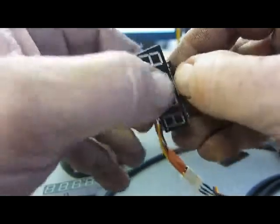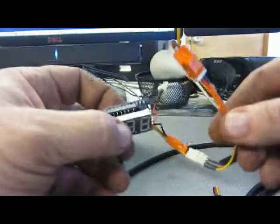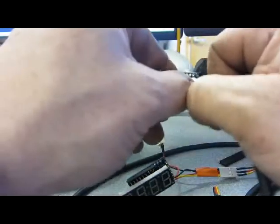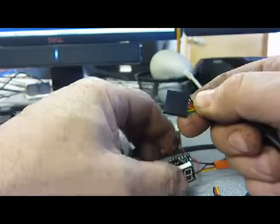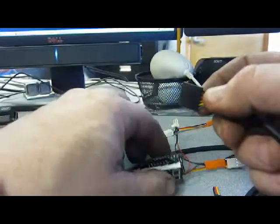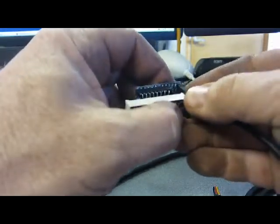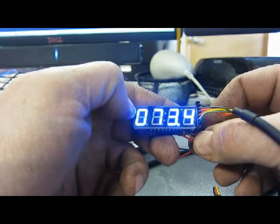So, with them all in there, in your tester, and with your thermistor on there now, you can plug it in and see if that works. When you plug it into the computer, looking at this plug thing here, it's got a black wire on the top and a green wire on the bottom. And if you notice on the Arduino, there's a word black at the top and green at the bottom. So that helps you line that up. The first time you plug it in, it should look like that.